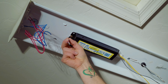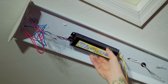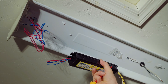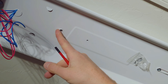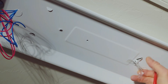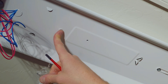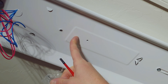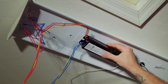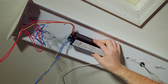We've got our wires snipped on both sides and we're ready to go ahead and remove our old ballast from the housing. Just like that, we can remove the ballast. Your ballast may have a machine screw on both ends — mine has a clip on one side and a machine screw on the other. It is important that it is screwed into the housing so it gives it the case ground. Now that we've got the old ballast removed, we can go ahead and insert the new ballast in just the reverse manner that you removed it.